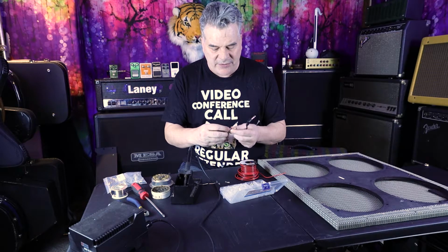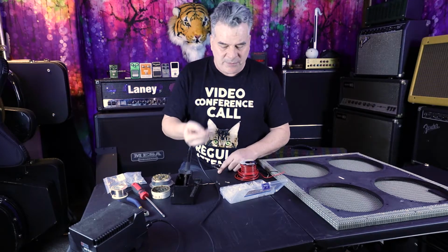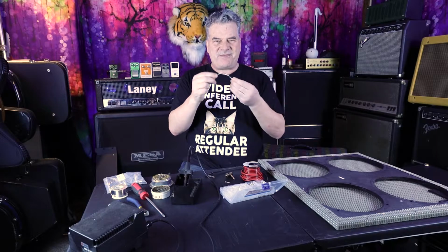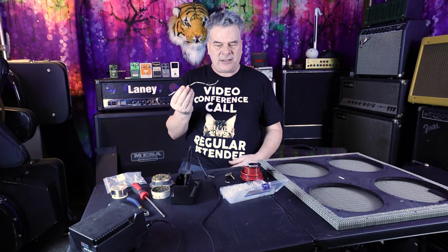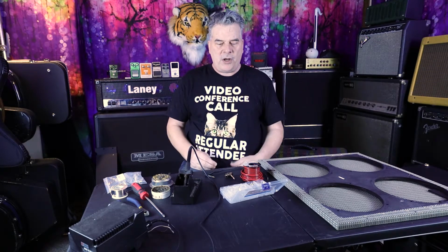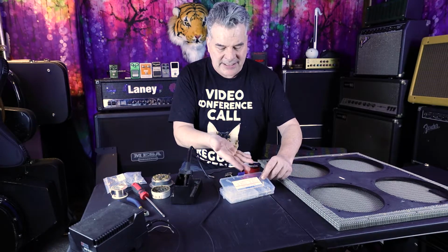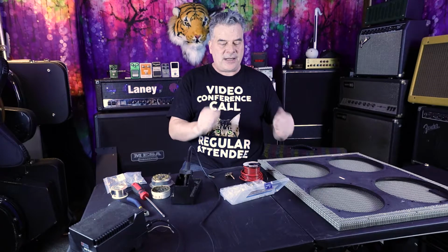I actually have a replacement Fender all metal housing, a much smaller profile 1/4-inch plug that I'm going to use, and it's not that hard. I've got some nice 18 gauge wire, nice and flexible, modern. The wiring I pulled off is just kind of brittle, maybe 22 gauge and brittle. It's just easier to solder up a whole new wiring harness. And besides, I've got these, what do they call them, speaker lug connectors. I got a box of these off of Amazon for a couple of dollars. It's not that expensive, and I can create a nice quality wiring harness.